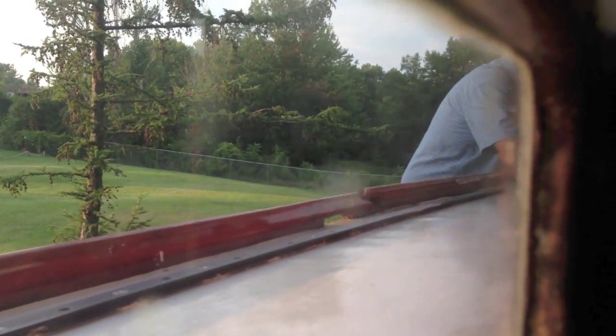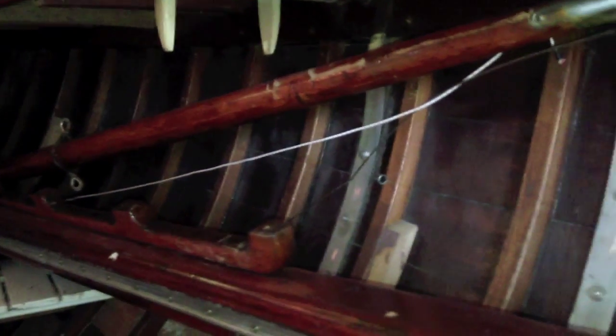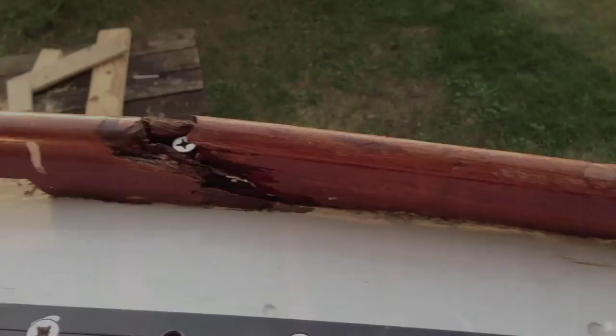Looking out the portal here, we're looking at the tow rail where it's broken back there. Where the light is shining through is the upper plank — I just want to show folks that that plank naturally opens up a little bit. It sheds light and lets light through. You can see the carlin has been riveted in place up there, which is the way they built them in Norway. The planks are all edge-glued except for the top plank. A little bit of light shining through, but that will close up once it's in the water. You could also caulk it — it's above the waterline. I wouldn't touch anything below the waterline. Looking at the inside of the hull just below where the tow rail was hit, there's no damage under there. The plank is clean. Just a little bit of light through that top plank.